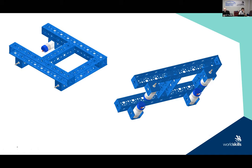Right. Okay, so that forms the core structure that you see there. And then with our motors on the bottom here, we've used two 48 millimeter U-channel packs, so there's two pieces in a pack. We open that up, and then we put the motor mount plate, the 76140, on, and we can mount those motors directly into the frame structure. So, base frame, there you go.